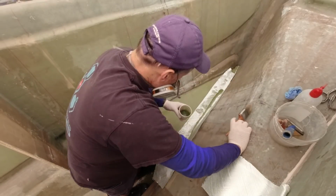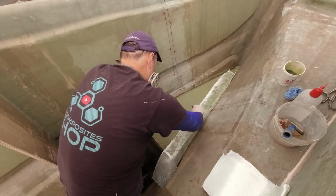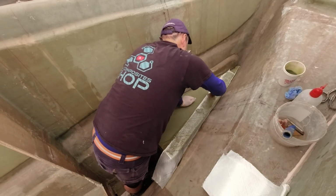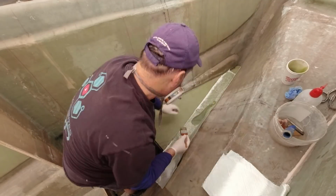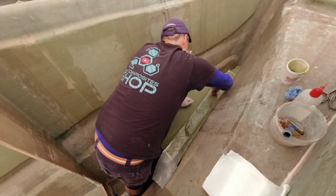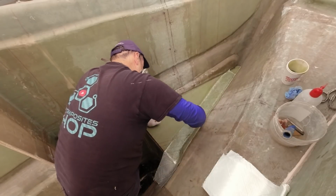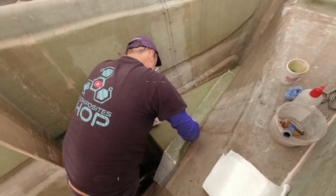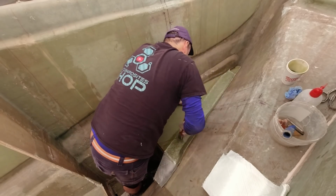And then I'm using vinyl ester over the top for any tabbing of any bulkhead. I'm not using any polyester in my boat for tabbing of bulkheads, other than in the shelves of the partitions. The partitions themselves are being glued on with polyester, and then basically with vinyl ester tabbing. So I'm remaining within the bounds of the chemistry and providing the structural strength where needed.